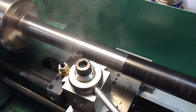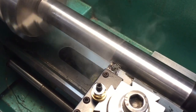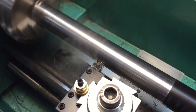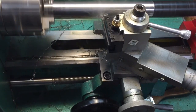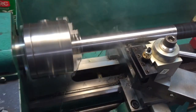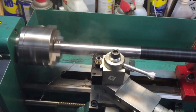Black pipe isn't machined exactly. But as you can see from the chip coming off, we've got a nice chip coming off. It's not breaking, but you can't ask for everything, right? Anyway, this is the 7x10 lathe — it's got an auto-feed. And we're just taking another two-thousandths off this piece of black pipe. It's got to fit inside another piece.